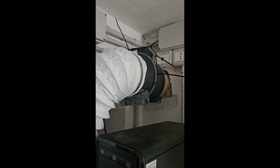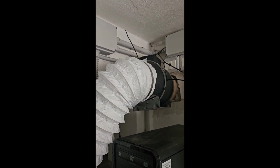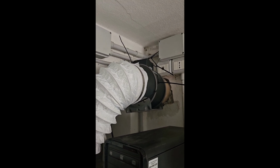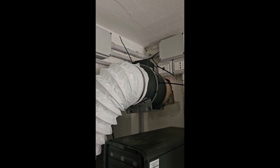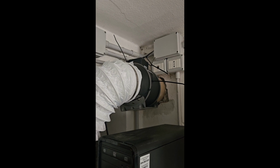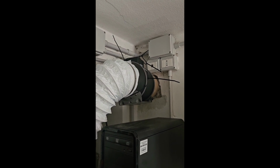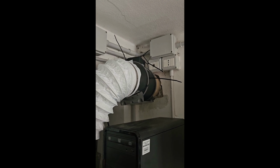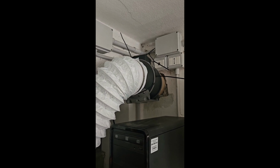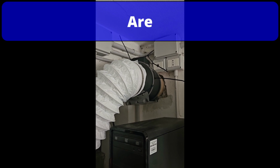So let me get my laser back together. I'm going to burn something and look at the way the smoke is extracted. I've got an anemometer, so I can measure wind speed, and I'm going to see whether I get more wind speed due to the lack of resistance of the new hose. So you come and join me in this experimentation. I'm filming as I'm doing it, so the results are pretty much live when you're watching. It's not staged at all, as is all my videos.